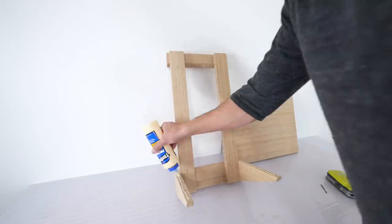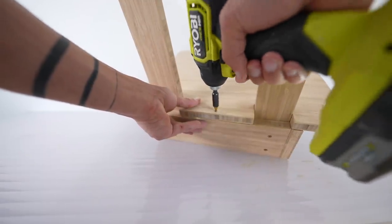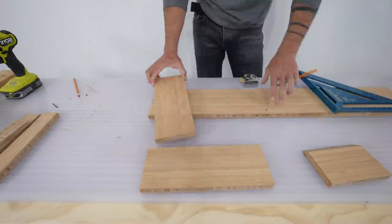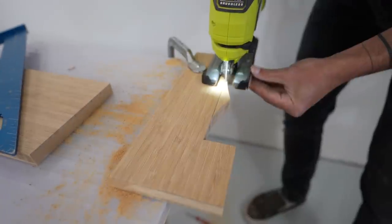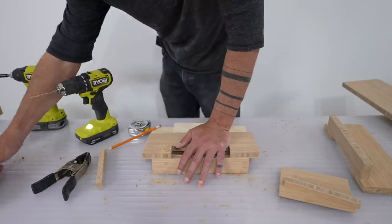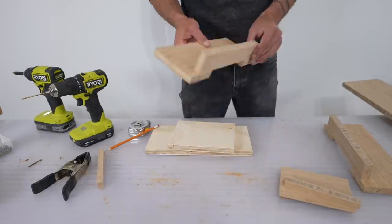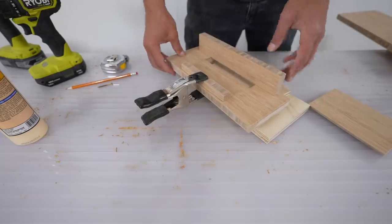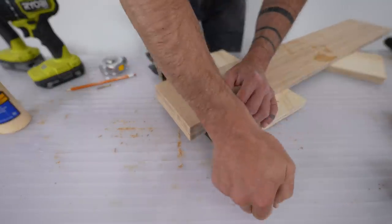I applied a little bit of glue and used a couple screws in places where they were barely visible. I love album art, so I wanted to make the vinyl record holder also a way to display the front covers. I followed a similar process but used one wide vertical strap, and cut out pieces with my jigsaw so they'd go around the vertical support. I screwed a strip onto the back for fastening the shelf to the vertical support, and glued a small strip on the front to keep the records from slipping off. I glued an angled piece of cleat to the back of the vertical support and will add screws once it dries.